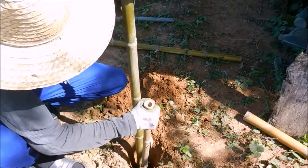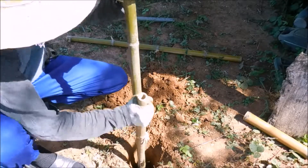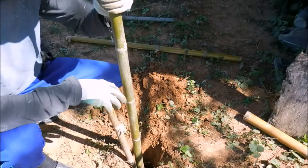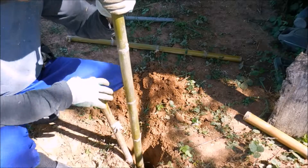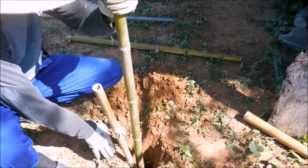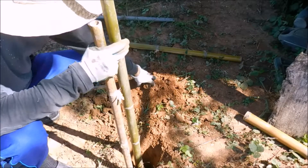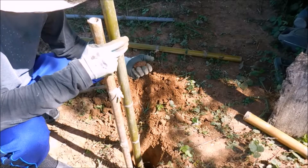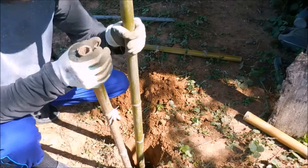This is perfect. And you just want to pound down every layer of dirt — put a bit of dirt in, pound it down. That's why you get it really compact. By the time we get up to the top, this thing is like it's setting concrete. This soil here is nice red clay — that's a bonus for this. Nice red clay is going to pound down; this thing is going to be like setting concrete when I'm finished.